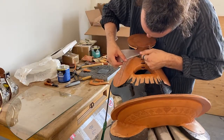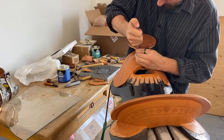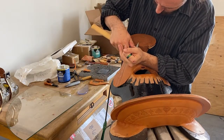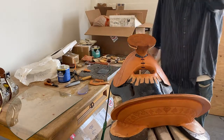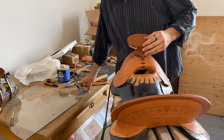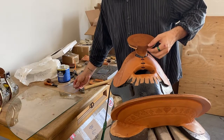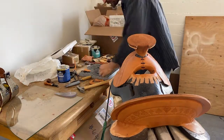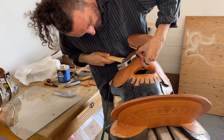Smooth everything out. All right. And if you've got excess and it's puckering where you don't want it to, come in here either with the tip of your, oh, I'm sweating too much. Shouldn't be too bad. With your bone folder or the end of your claw hammer, all right? And then we're going to put a single nail on either side of those tabs to make sure that doesn't pull up. And again, either 1/2 inch or 5/8 nails would be fine.